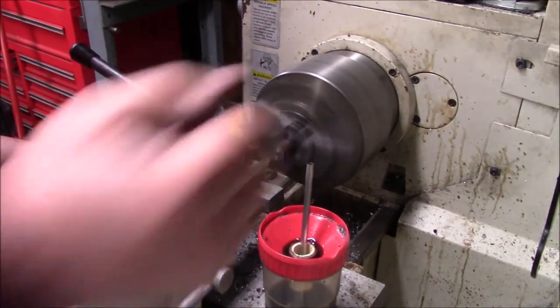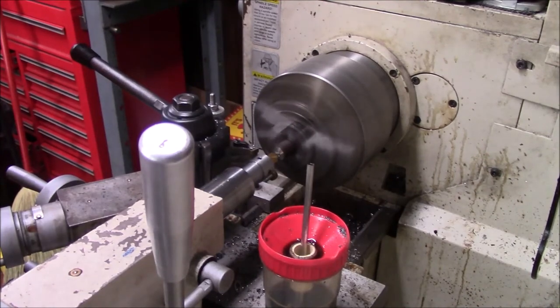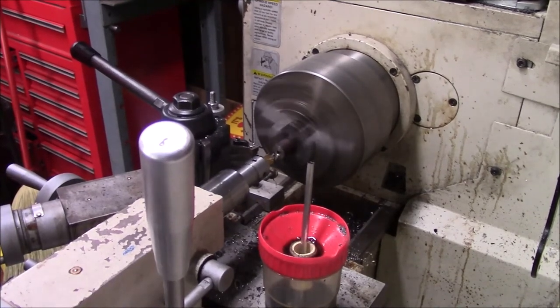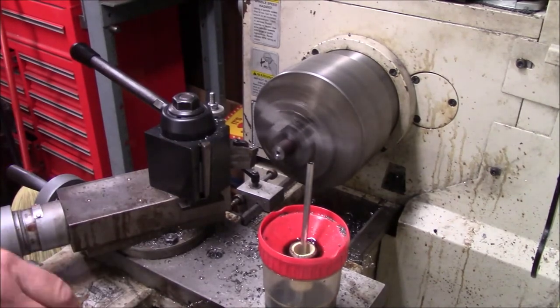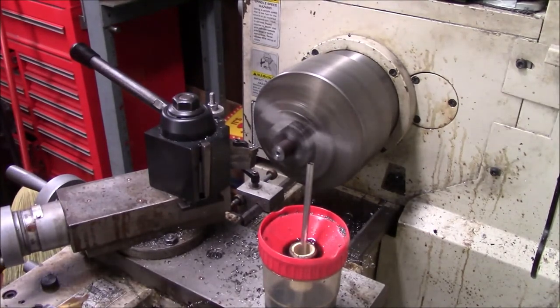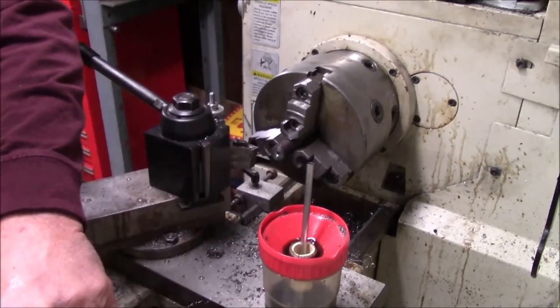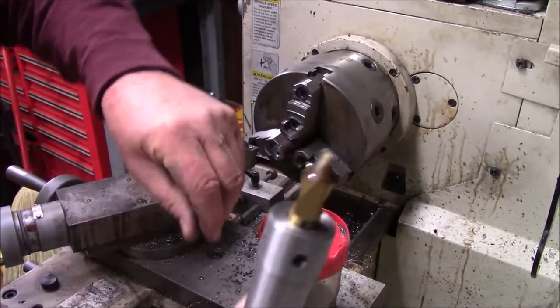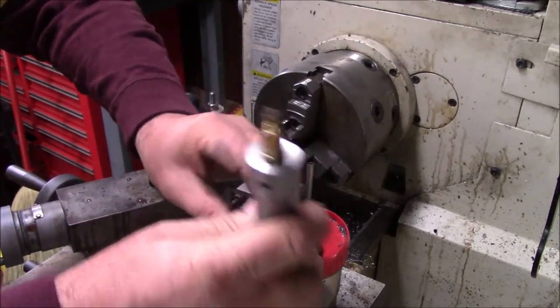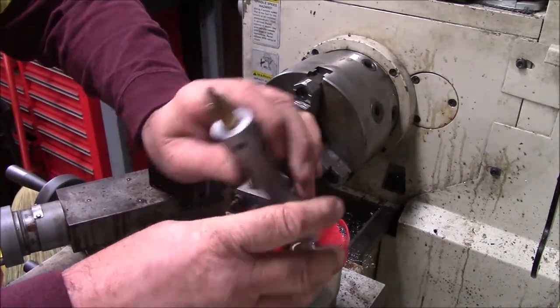So we're going to bring this right up — let's just see if it walks or it drills. It drills perfectly! That was what was wrong with it. There it is — that's the thrill of victory, not the agony of defeat. I consider my repair of my little mistake all done. Every time you make one a sharp-eyed viewer mentions it. The first time I used this tool I drilled in plastic and didn't drill in steel. First time I put it in steel I discovered it. Basically this Double Boost inspired center drill holder is now repaired with a proper bushing in it.